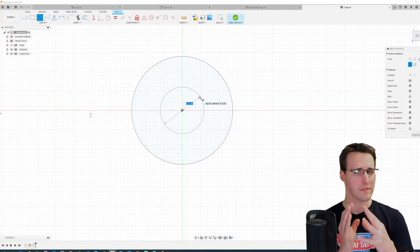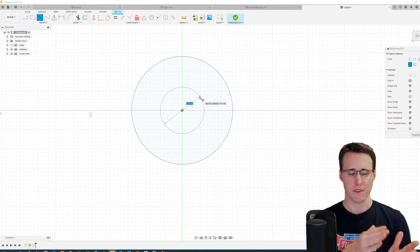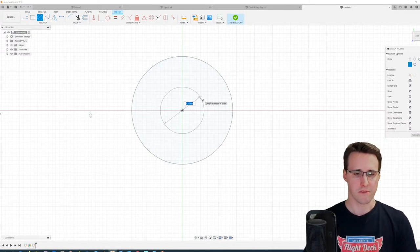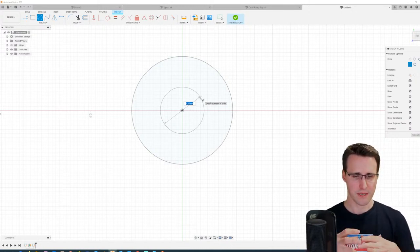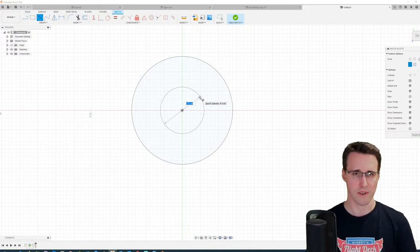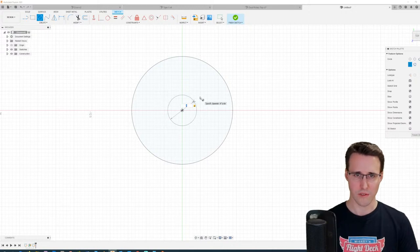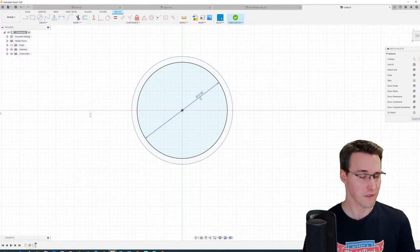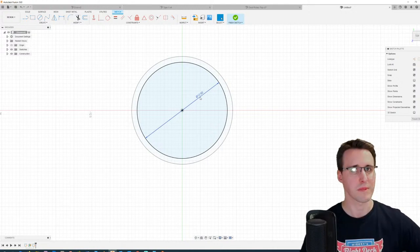And this will be a little bit smaller, the circle now. Maybe you have seen this on the dual rotary encoder top knob, 16 millimeter bottom diameter and 14.5 top diameter. So 1.5 less. Let's try this here too. So if you don't want to calculate it, we can say 14 minus 1.5 and we come out with 12.5. Not that I couldn't calculate this, but just to show it to you.